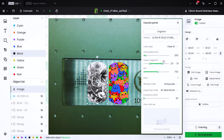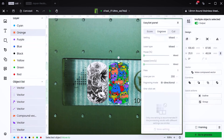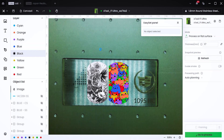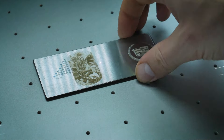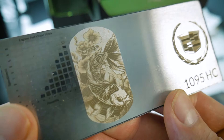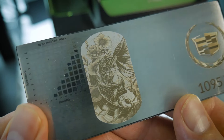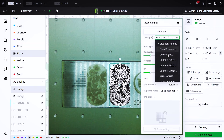Now we'll switch over to the 1095 high carbon steel. Since we won't get very vibrant colors from the blue laser, I'm going to import a grayscale image of a koi fish and focus on the IR laser. The results are pretty similar to what I got on polished plated tags in the previous video. The IR laser produces a semi-gloss finish that looks very attractive, with excellent consistency converting white, black, and gray shades from the graphic into silver, gold, and brown shades on the material.